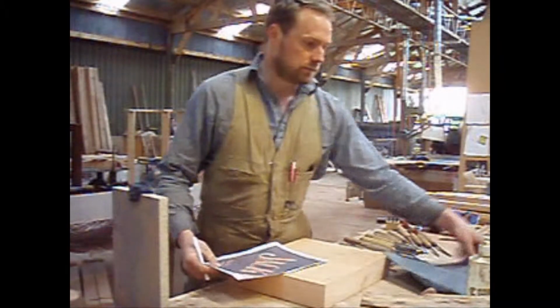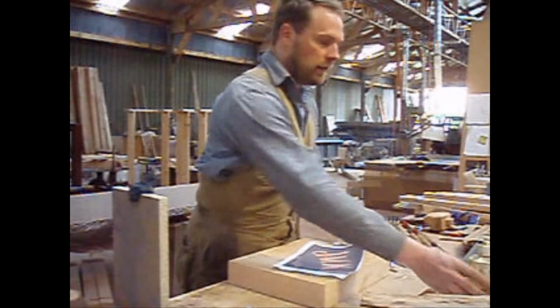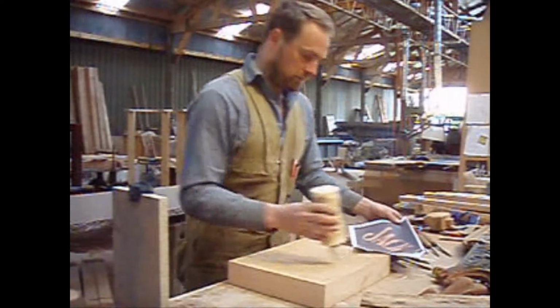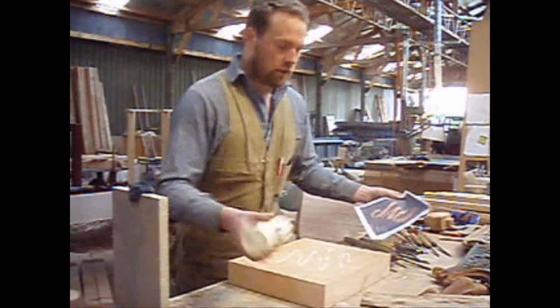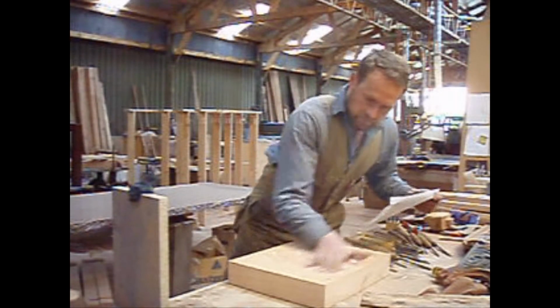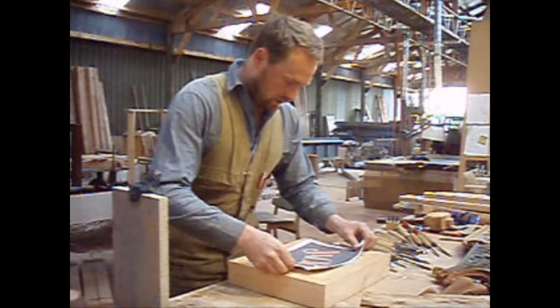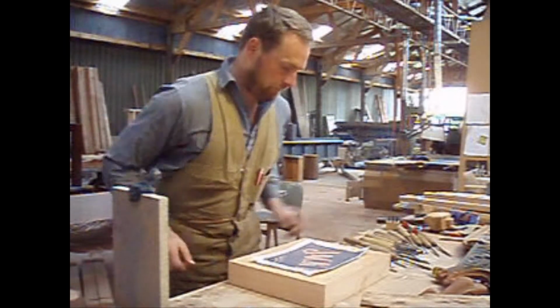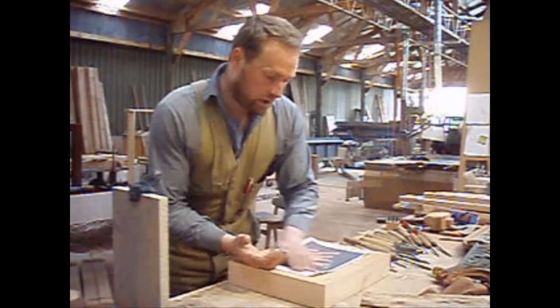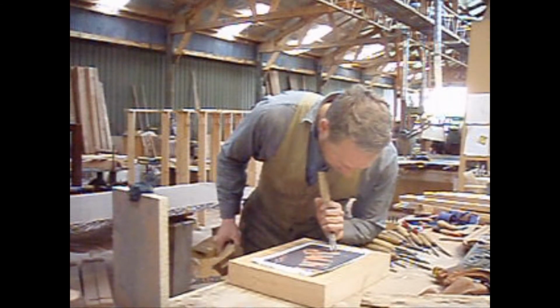There it is marked out. The next stage is scribing, and that's the line I scribe to. Or a quicker, faster way is to size the panel, with plenty of adhesive, and then just pop it on, paper and all. Saves time.